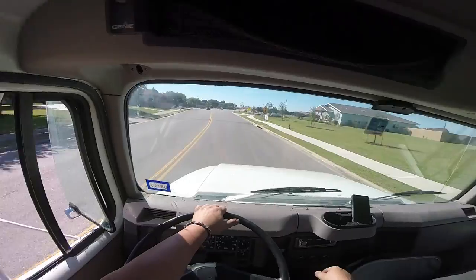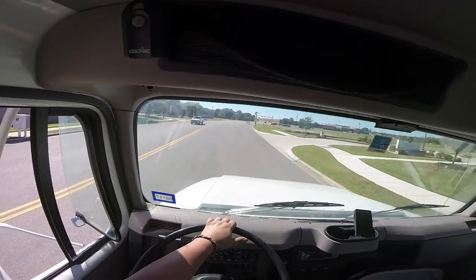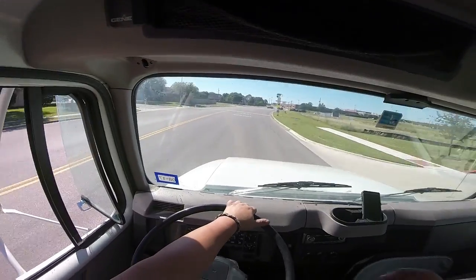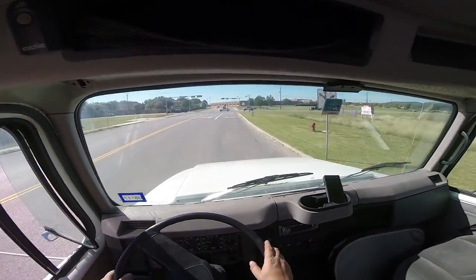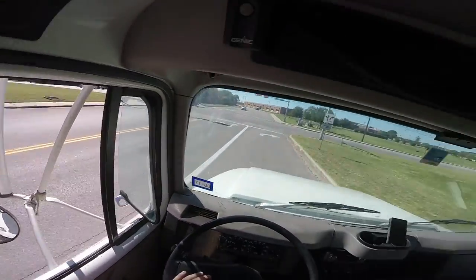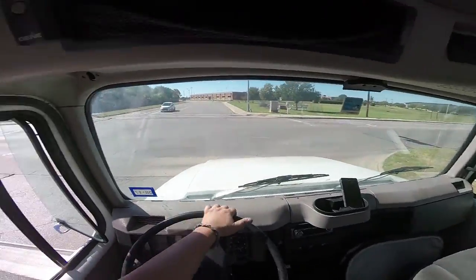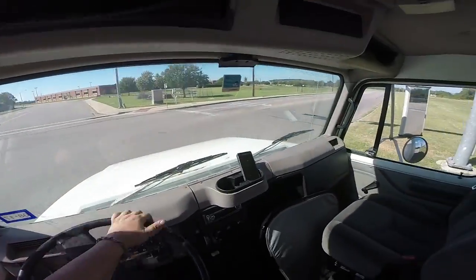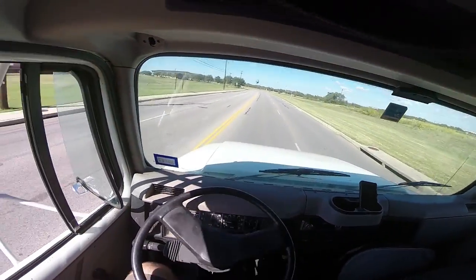So then today I got the coolant filter replaced. That was a huge pain in the ass. Basically did a coolant flush as well, because I dumped almost 5 gallons worth of fluid on the ground, because she took 3 gallons of concentrated coolant and another 2 gallons of DI water. And that's the lesson people need to learn right there: you really want to use deionized water. Otherwise, your filters and stuff are gonna rust, and then it sucks getting them off.